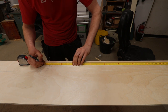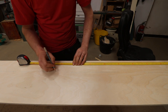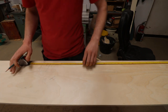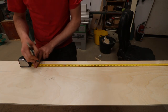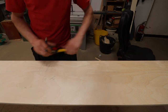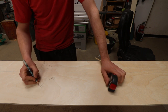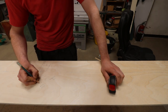So we've got 1107, I'm going to take that 100 mil off, so it's 1007 millimetres. That's the cut height for this specific window, but the overall height is 1055. So if we're doing multiple windows using the same dimension timbers, we just need to work out the difference between the two. So 1055 minus 1007 gives us 48 mil, I think. Yeah, 48 mil